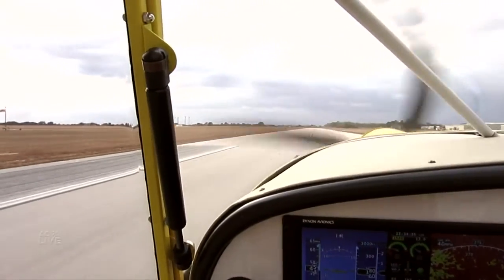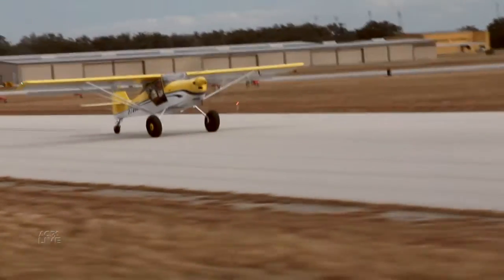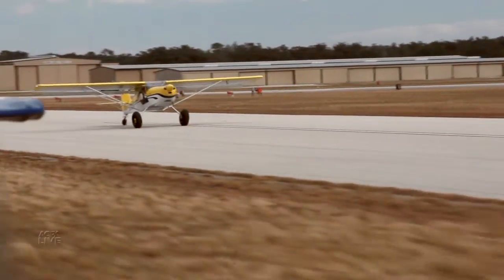One reason for the good performance: the SLSA version has a restricted gross weight compared to the kit-built airplane. The SLSA we produce is actually a 1,550-pound maximum gross weight capability aircraft in the experimental category, but it's registered as a 1,320-pound max gross weight for the SLSA. Having that much higher gross weight capability puts it in a safety category that is much higher than a lot of competitors — it's just built stronger, period.